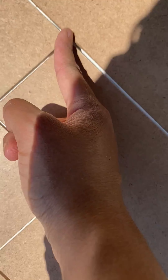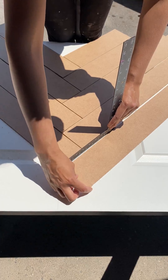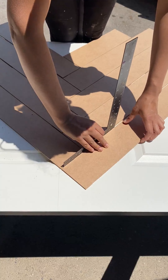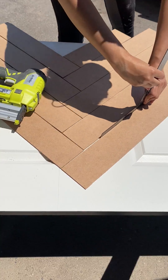What you're trying to do is match up all of these points to try and match them up on the center line as close as possible. So I'm going to put this here. Then you need a spacer — you can use anything as a spacer. I'm just using this because it's long and handy. You press the wood up as close to it and then you nail it in. You do the same thing on this side and just continue on with the pattern. You bring this close to the line, but you also need to make sure it lines up with this edge and then push it up against your ruler. Then take your nail gun and nail it in, then slide your ruler down and nail it in again.